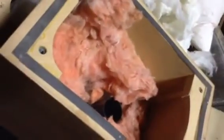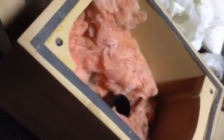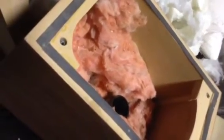Now, a lot of people use spray adhesive. You can spray the inside of the cab and then stick the stuff to it. Or you can simply friction fit it in there like I have. Just be aware that you don't really want this stuff falling into a pole vent or some kind of mechanical device on the woofer itself. The compression drivers are pretty safe.